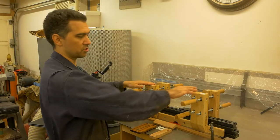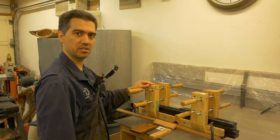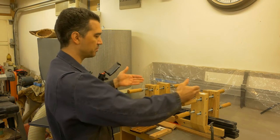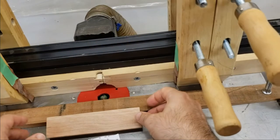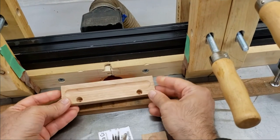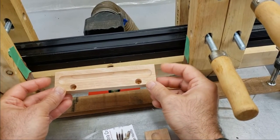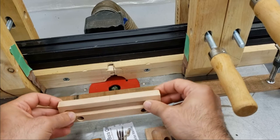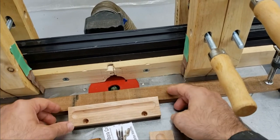These are the so-called Jorgensen's clamps or hand screws, depending on which side of the world you are, and they're positioned on either side of the bit. And that gives me a start and stop position so that I don't route beyond the edges of my pen case. I also have fake stops right here, which are the width of a veneer.